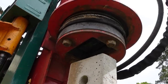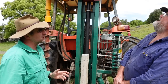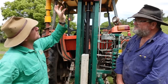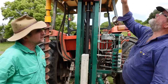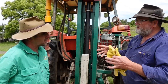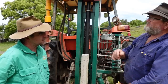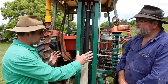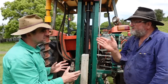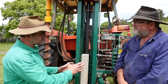Now your percussion driver, it's got a pretty special little head on it. Yeah, you had that made for you by Munro? Yes, Munro put that together for me. I noticed all you've got to do is just line it up with the post initially. Well it just sits in the ring — one of their standard rings which is their normal guide to hold their posts in position when they're driving. It just drops straight in one of the rings. And that lets you move the mast around with all of your controls so you can have the tractor at any angle to the post. So you can actually get the post straight in the hole.